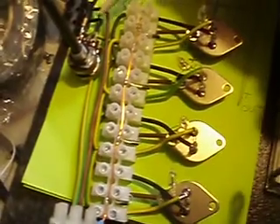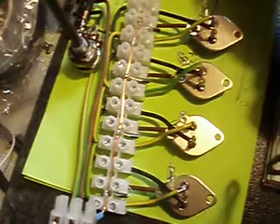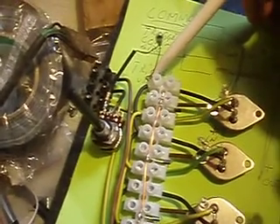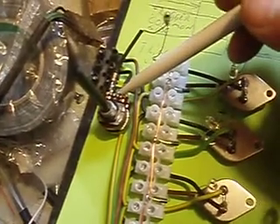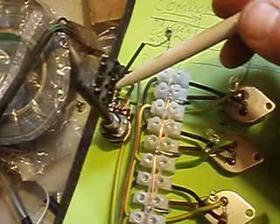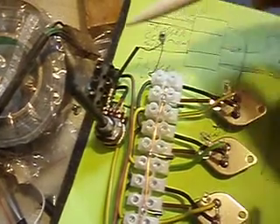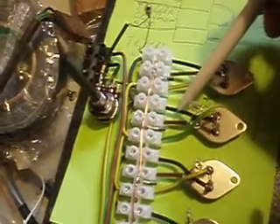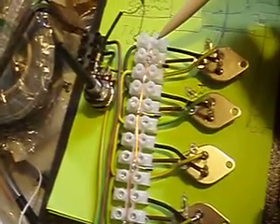Hopefully you can get something out of it. My trigger winding goes in here, goes out there, and goes in here — it would help if I showed you where I'm pointing. I'm sorry, I have a fever. The trigger goes in here, into the variable resistor, out to the 100 ohm resistor, and through the light bulb into that one, and that one goes to that one, and so on.